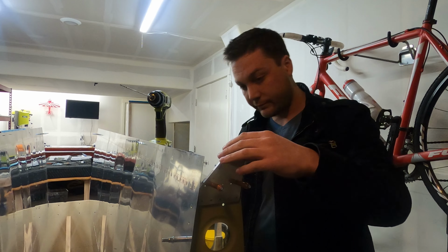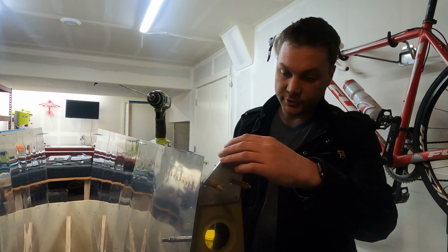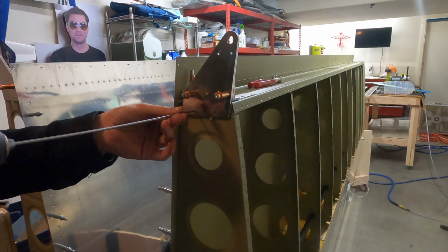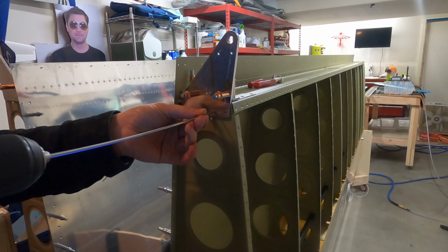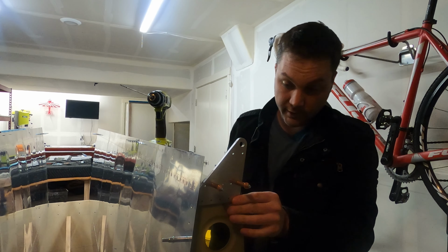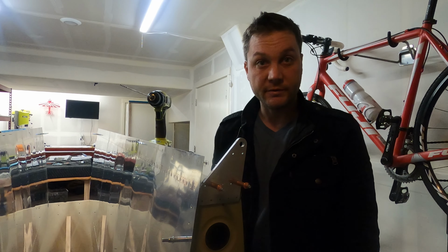Bracket here has you drilling 4 or 5 holes into the rib that were never pre-drilled. So it was pretty important that I make sure, to me, everything's flat and flush, and this is why I focus so much on deburring all of these pieces to make sure that we were getting all of our gaps tightened when we go to drill these holes and subsequently rivet these pieces.